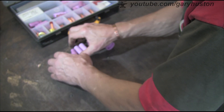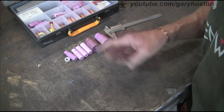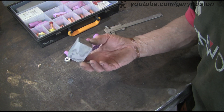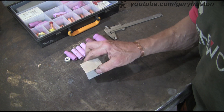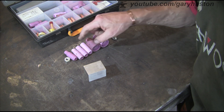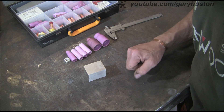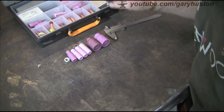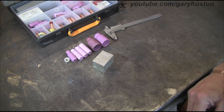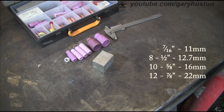So what we're going to do is try and make something that makes setting that stick-out very easy. I'm new to TIG welding so I'm going to use this bit of aluminium off-cut, and drill myself some holes in it corresponding to the depth or length of the stick-out. Some people might say this is unnecessary, but when you're learning, a little thing like this you can just chuck in your box with all your bits and pieces - quite a handy little thing. So I'm just going to stick up the sizes - if you want to pause it and take them down, and then we'll crack on.